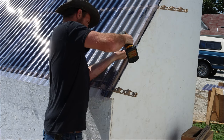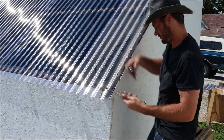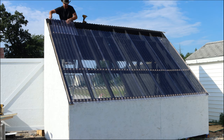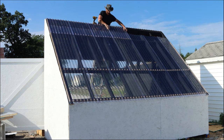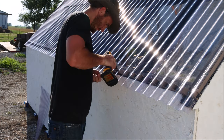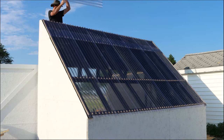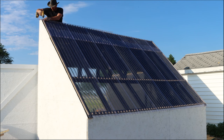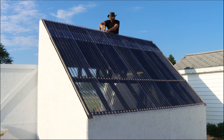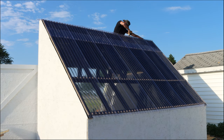On mine, you're not going to notice unless somebody points it out, but there are a lot of little cracks all over the roof after I installed it. All of the pieces do overlap a decent amount, so I'm really not worried about any water or heat going in and out — it's really just an aesthetic issue. The last piece I need to install for the roof is the ridge cap. Home Depot never had any ridge caps in stock, so I ended up using some scrap pieces of the polycarbonate sheets — this works well enough, but if you can get a proper ridge cap, that would be more ideal.